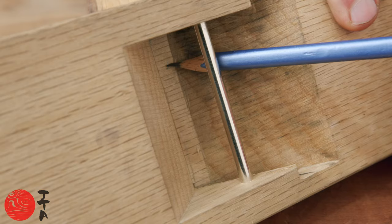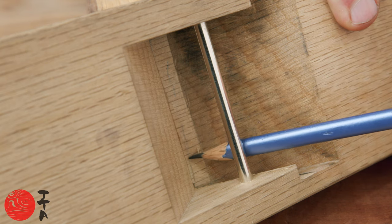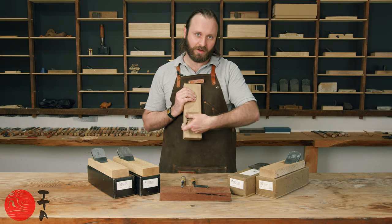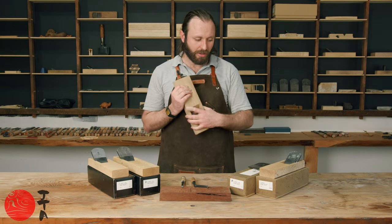So what's a Tsutsumi? The Tsutsumi is a small shelf that sits at the bottom of the ramp that holds the blade. It is at a different angle to the block that holds the blade, and it mirrors the angle of the bevel as the blade is seated into the block.